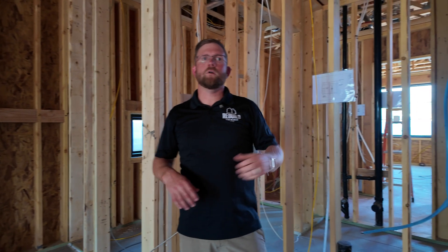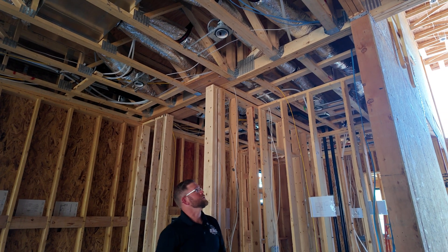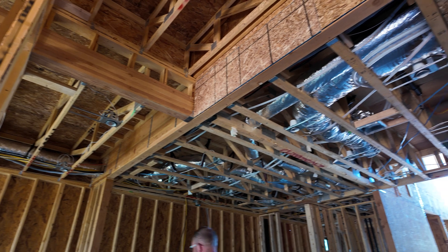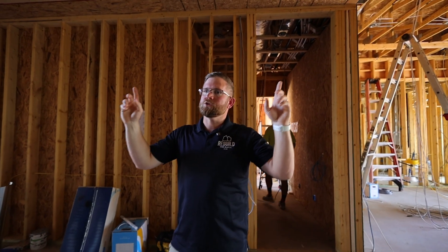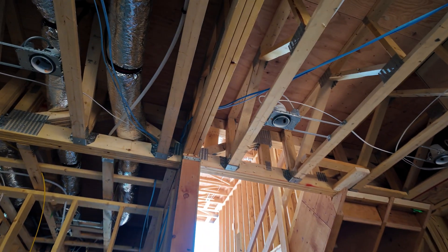Moving to the kitchen space, we don't have a clear span truss — we're actually hanging our trusses off of two specific structural items. The first is our three-ply girder truss with associated hangers, as well as a 6x6 post detail that allows an additional girder to hang off of a glulam beam located between the dining and kitchen space. Essentially these trusses aren't resting on a top plate but are truly hanging suspended over these structural members, all designed specifically for this house by our structural engineer. A glulam beam in this location wasn't sufficient because it wouldn't allow us to run all of the necessary mechanical components throughout the truss system.